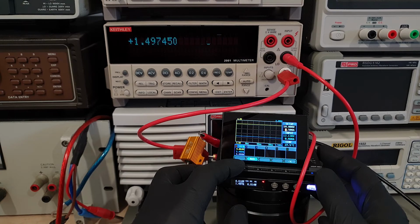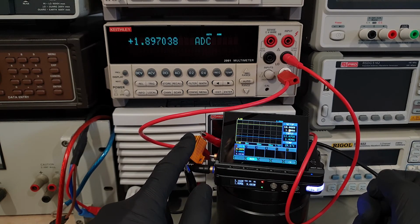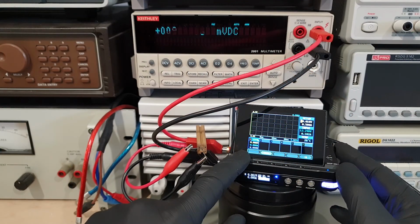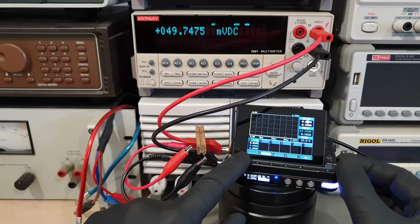In no case did it reach its insane output accuracy spec of 0.025%, but it's usually better than 0.5%, and that is, in my opinion, good enough. Voltage-wise, it has a 10 mV programming resolution, and a similarly good, but not always within spec, output accuracy. It's also in the 0.5% neighborhood.